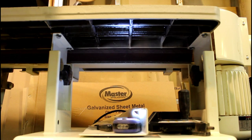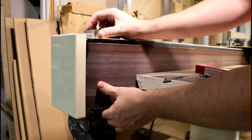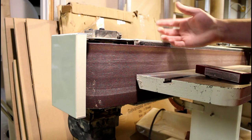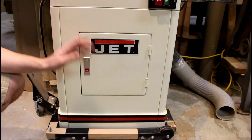One of the last things I didn't like about this machine is that when you load new belts on or change them, sometimes you've got to articulate this oscillating head just a little bit and it snaps into place. I'm not sure why it does this — I couldn't find anything in the instruction manual to explain it, but if you don't do that the belt doesn't track correctly. I'm not sure why it doesn't always return to the same position mechanically. Now let's talk about the pros. It offers a really robust motor. The machine is very well made and solid — some of the thumb screws are a little cheap, but overall this machine is a very high build quality.